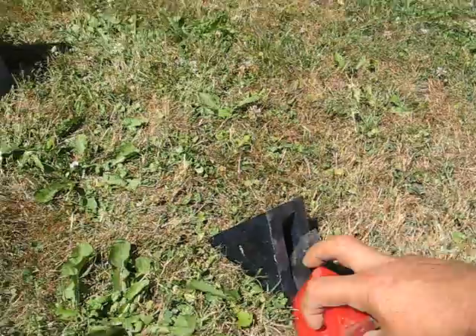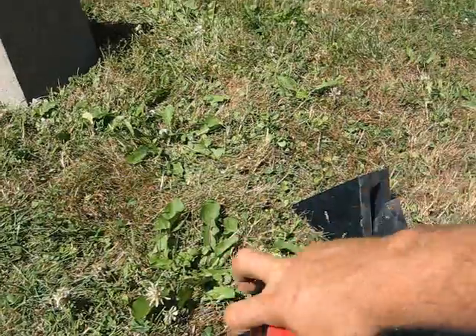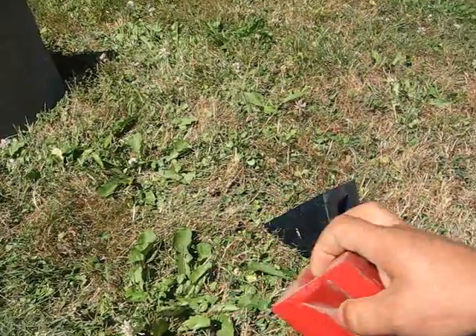The problem with this shape is that in terms of popping out of a mold, this creates an undercut, so it can't release from a mold. You have to have sliding cams to release these three half diamond shapes. So I thought about how to create an interlock without an undercut.